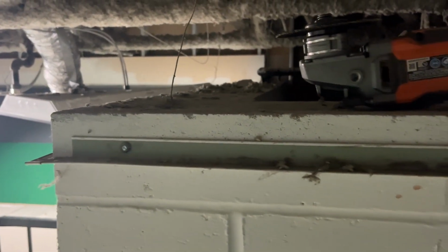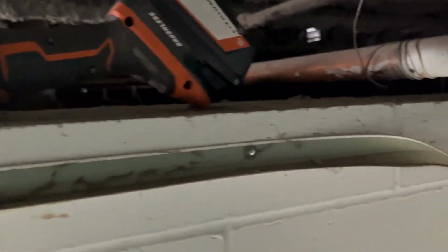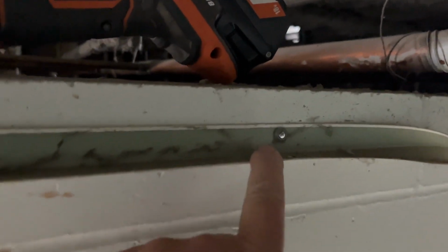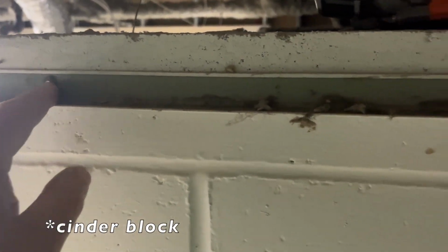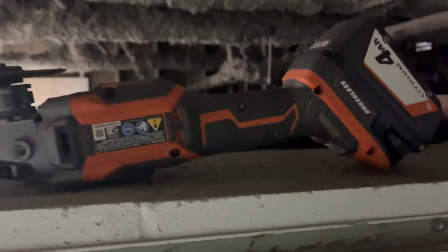Well, these are proving to be a little more challenging than I first thought, although I think I have a system now. I started the first two just trying to pry these off with a crowbar. These are not coming out of the concrete, these anchors. They are in there. And yeah, it's a lot of work prying these off. Plus I'm at the top of a ladder, and so leverage is a thing. But yeah, angle grinder. I just cut the heads off.